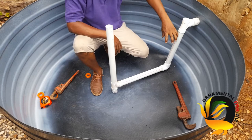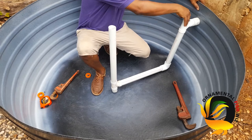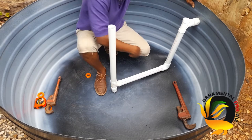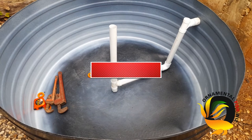The tee over to the side of the vat is positioned low because it also acts as an overflow. If there is any blockage at the base of the piping, as the water rises it will flow over into that pipe area. The middle section is a little higher, which forces the water to drain out there. So you won't have any problems if the bottom section of your drain is blocked.